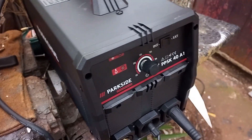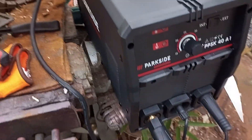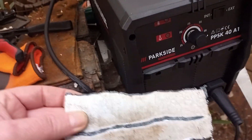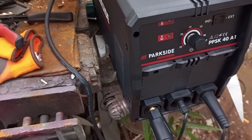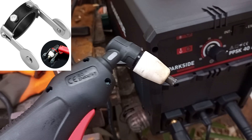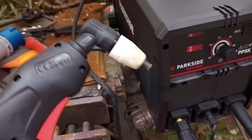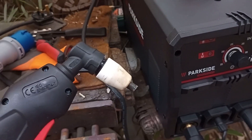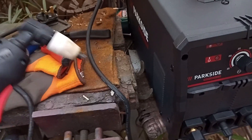So I did cut some metal with it. Silly enough I had it on 40 amps so it chewed that up. I knocked it down to 35 amps — very nice, not much tidying up to do. You get a little cradle thing that fits on the end of the torch, but I've got to find out how to adjust that properly. You obviously have to have the tip just close enough for it to arc.